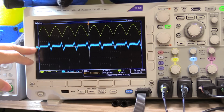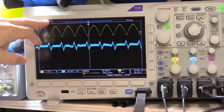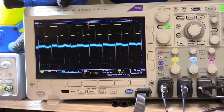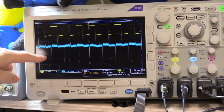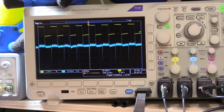With a sine wave, you can see there's still a little bit of a transition as it goes between no load and as the load comes up, but it's actually dealing with it quite well. And if I go square wave, all right, now we've got the sharp edges. We're getting these higher spikes on the leading and trailing edge where it's compensating, but it's still 20, 40, 60 millivolts, probably 100 millivolts with the extra bit that you probably can't see on the scope. Considering that's a square wave, like a post-load step change, it's dealing with it quite well.